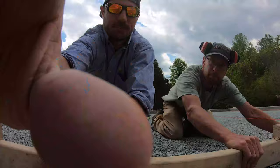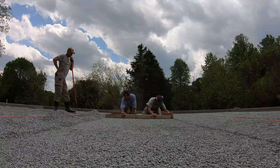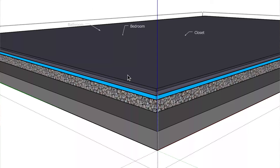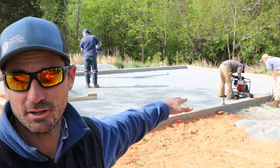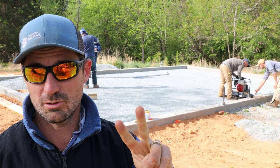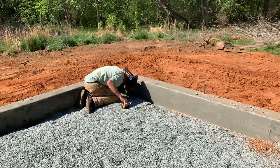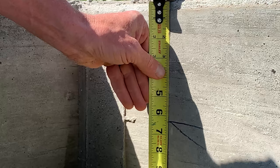The first thing we do is cut a seven-foot long board, making sure we have at least six feet. In this case we have a four-inch slab and two inches of rigid foam insulation underneath, so we have six inches below the top of that foundation wall that we're trying to get the gravel to. We actually shoot for four and a quarter inches plus two inches of foam — six and a quarter — with a quarter inch of wiggle room.